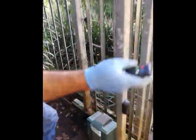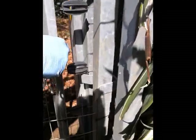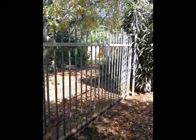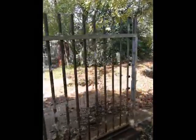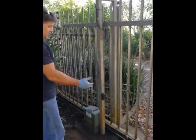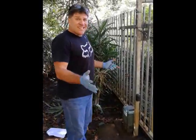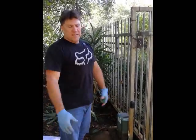The last thing to do is press your button and make sure the gate runs nicely to stop where it's supposed to. When the gate is in a fully closed position, there should be a little bit of a gap left — it shouldn't fall into anything. Press the button again and make sure the gate will run all the way to a fully open position. If your gate is set to auto close, make sure it will auto close itself. Also test the beam function — this gate is set to condominium mode, so it's closing straight away. Break the beam and it will stop and reopen. You can see the gate is functioning as expected. This concludes the maintenance on the sliding gate motor. We made this video because of COVID-19 and the lockdown, but people can also use these videos in future just to do a bit of maintenance. Thanks for watching.